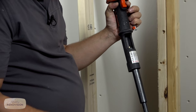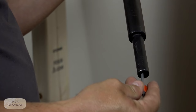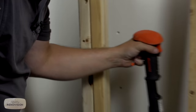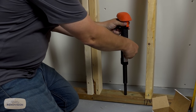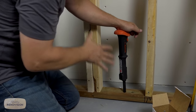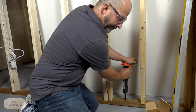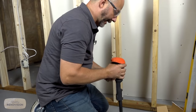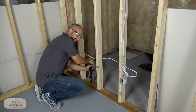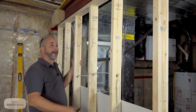And we just put that shot in there, right? But always put the nail in first. You don't want to be working with this and accidentally hit the trigger. So put your nail in, put it where you want to put it in the concrete, then add the shot, okay? And then we just set it down, and then you lock it in position just a little bit more, pull the trigger. Bam! .22 caliber action, ladies and gentlemen. Gets the job done every time. Fire in the hole!